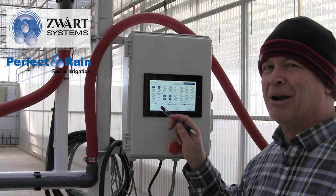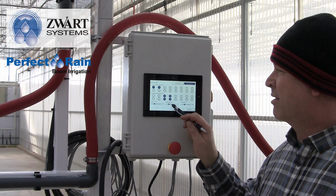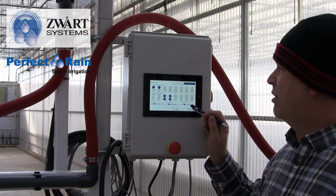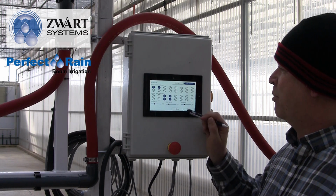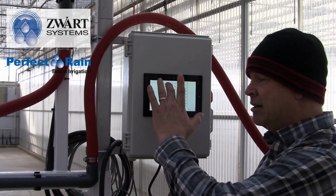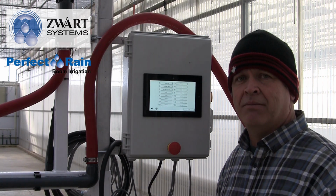It's probably a lot of water. Maybe go down to 40 seconds. We have our crop spread, the distance between rows of plants, and we have our jog speed, and we're set to step watering. We're going to save that. Now geranium is saved as a step watering program.